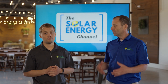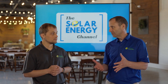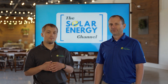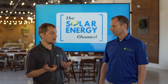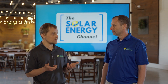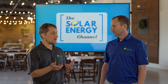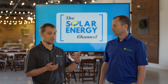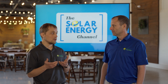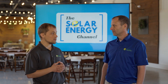So if I have one of these SolarEdge Energy Hub inverters, can I just add batteries at any time — is it as simple as plugging in batteries and ready to go? If you have the Energy Hub inverter you're in a pretty good position to add batteries, but there is an additional piece of equipment called a backup interface unit. That piece of equipment interacts with the grid, with your solar, with the batteries, with your loads, and with a generator potentially — that will need to be added in the future. But if you have the Energy Hub inverter, you're ready to add batteries and you're much farther ahead than just the regular SolarEdge inverter.